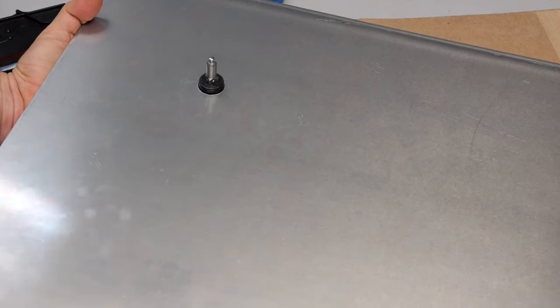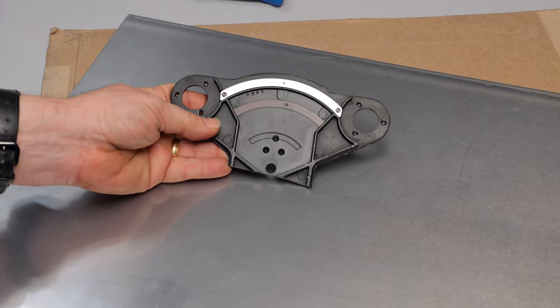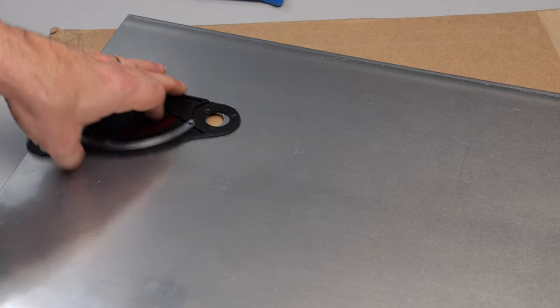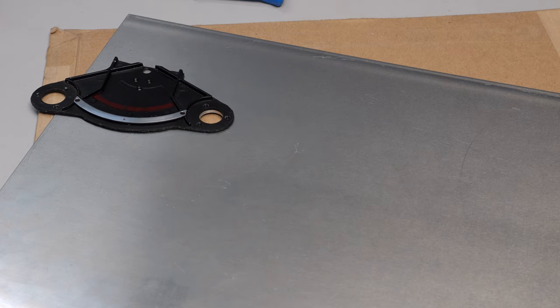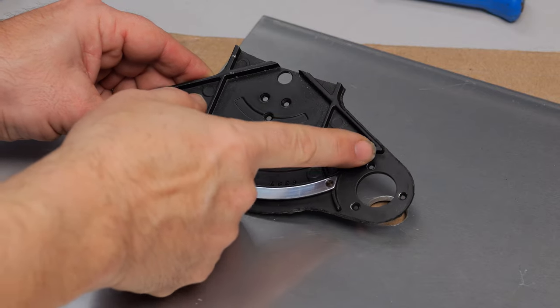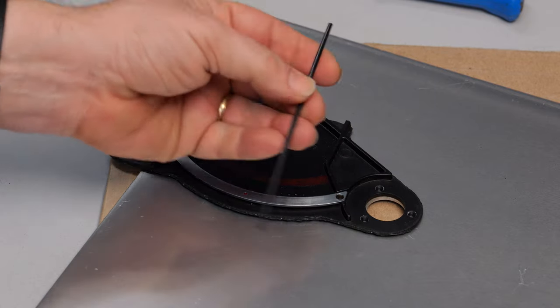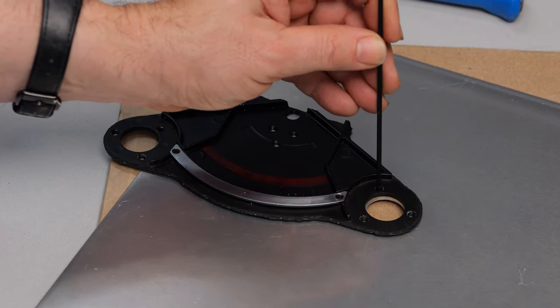For the film spindles — these spindles came from an Arri 16 BL magazine, there's a take-up spindle and a supply spindle. I made this little template which was made from a piece of the 16 BL magazine. I didn't feel so bad about scavenging this magazine because the rubber seals were shot in it anyway. The three holes that mount the spindle will drop into place; I secure it and use a center punch to mark exactly the center of those holes.